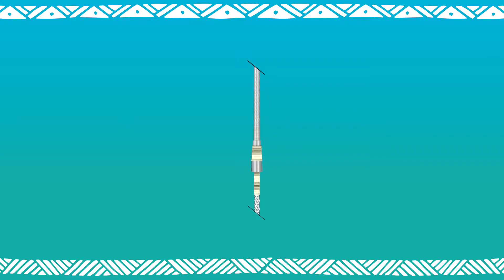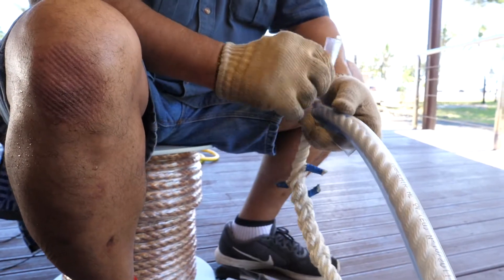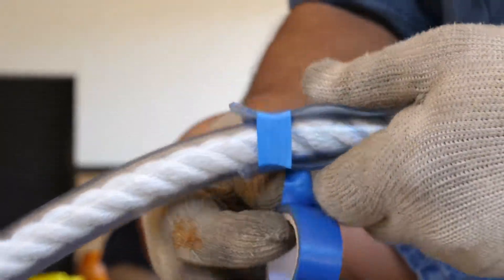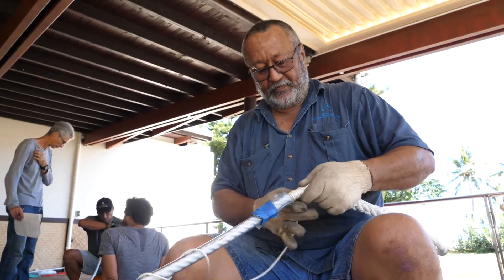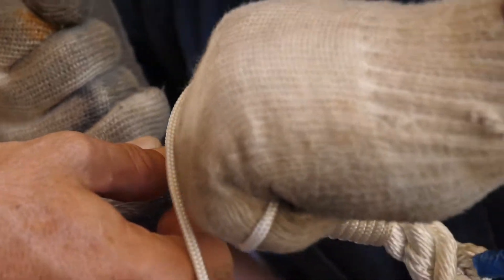Now that all the buoys and buffers are in place, carefully protect the main rope from the cutting ends of the polypipe. First, slit the polypipe on two sides and fold it back to itself at each end. Second, hold it in place with electrical tape. Third, whip twine around the main rope where the polypipe sheath ends — the whipping should cover about 10 cm on either side. Fourth, whip the end of the slit hose tight.